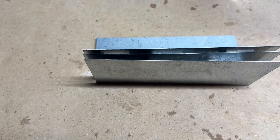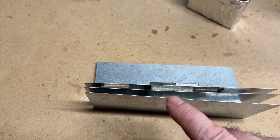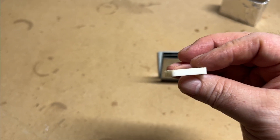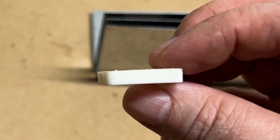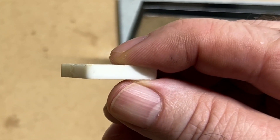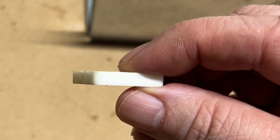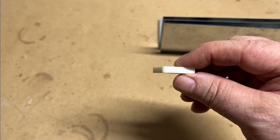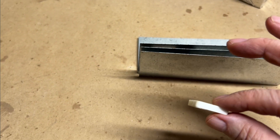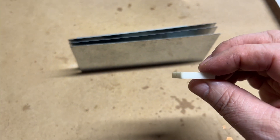What you have to do to make this work is create spacing. I'm using these spacers that came with the magnets — they're quarter-inch spacers. Apparently the magnetic industry who makes these magnets recognizes that if you get it just about this far apart, the person who purchased the magnets can easily separate them from one another without a lot of trouble. So I use these as spacers — they are perfect. This spacing changes everything. Less than this width of this, and it doesn't work.